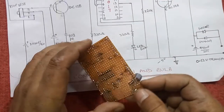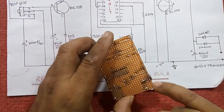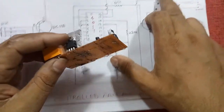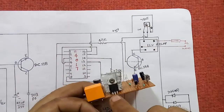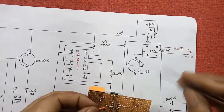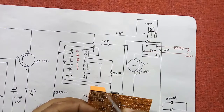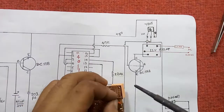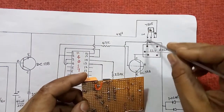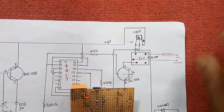Our input will be at this point — meaning the diode and negative of the condenser. Now let us connect the 7805 IC: the first pin is the input, meaning 12V. This relay also operates at 12V, so we have to give supply at this point. These two points have been connected, and this is coming to the diode and positive of the 470 µF condenser.